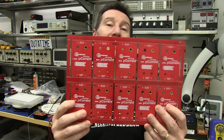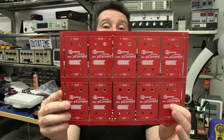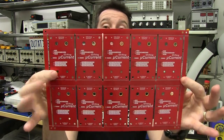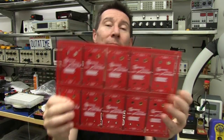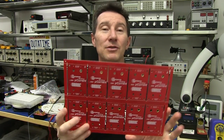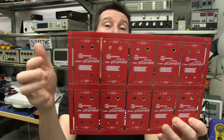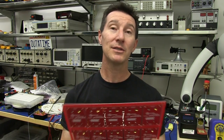Unless you're doing tens of thousands or hundreds of thousands, you don't often invest in an automated test system to plug onto the thing. But even for my microcurrent board — I'm doing a new version — I thought I'd just add a test connector on the side of my panel to help out and smooth that testing process. It really is simple to add just some basic features to your panel to simplify testing.